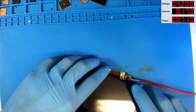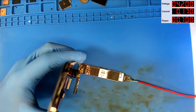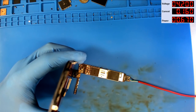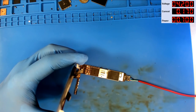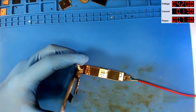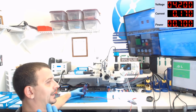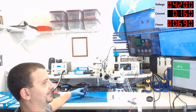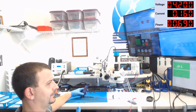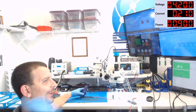So we have no image, so we really can't say for sure that this thing's booting. In fact, it seems to have kind of run a little flat here, hanging around at 170 milliamps. Can we see some activity, please? Maybe it's just booting really slow. Well, I'll tell you one thing it is not: it is not 80 milliamps and looping, so that's a good sign. 160. I would just like to see any hint of activity, like brainwaves, drawing more power, drawing less power. Come on. 180, so we got a little more. 250. We are going to be in good shape here.